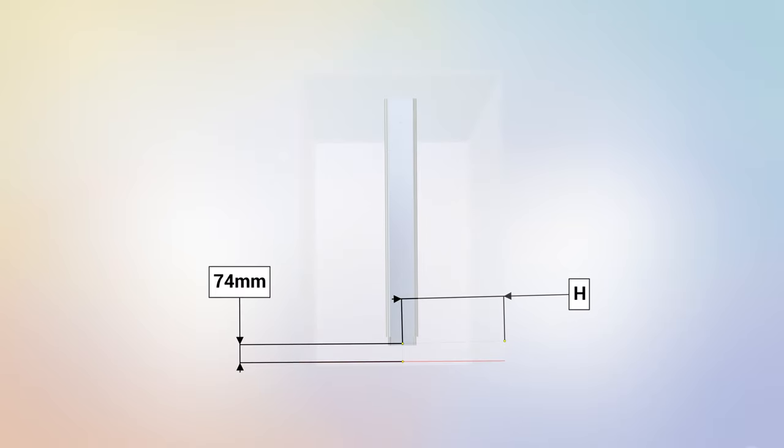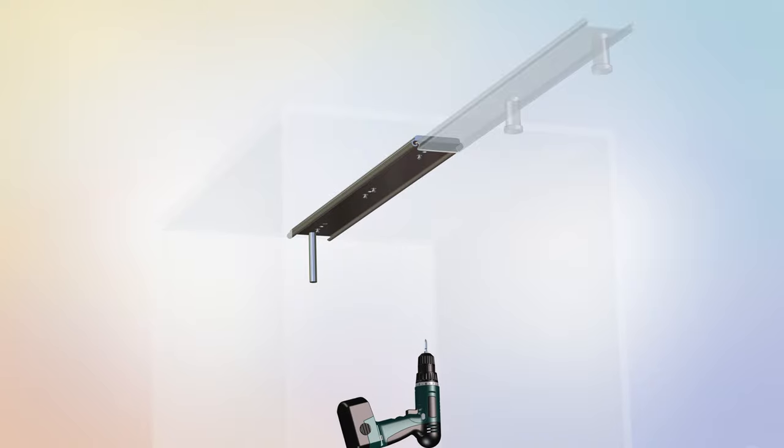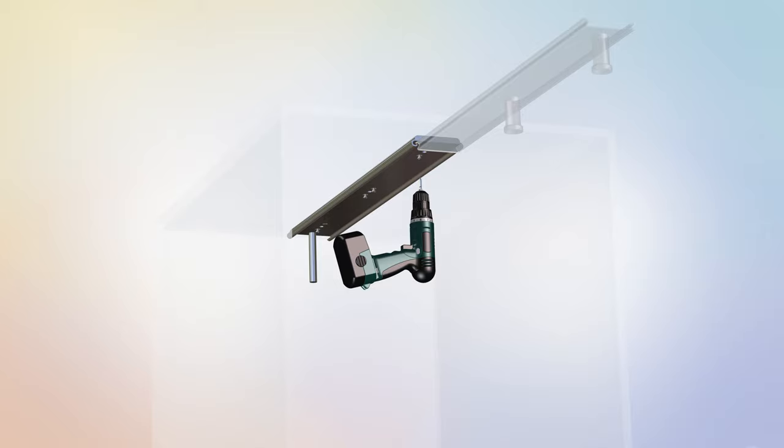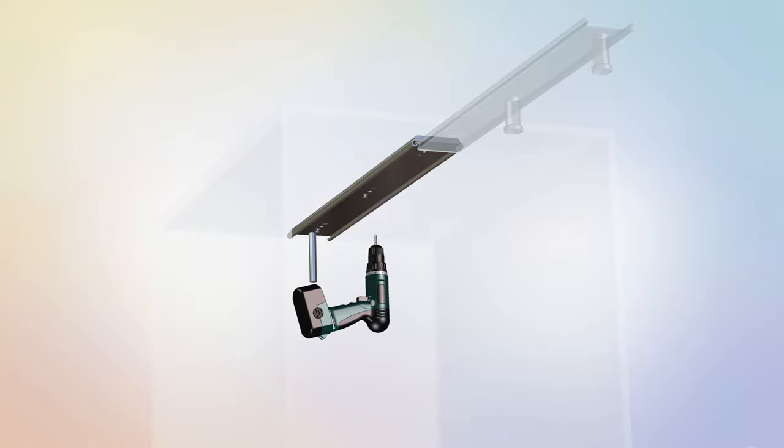Part A will be placed in the centre of the inner cabinet rooftop with a spacing of approximately 74mm from the open cabinet end. Please reference the correct number of millimetres from the edges as shown. Slide the track out of the way and secure part A to the cabinet using four part L screws. Tighten the screws using a power drill with a Phillips head drill bit. With the assistance of another person, ensure that part A remains intact and in place as it is being secured to prevent misalignment. Take care not to over-tighten the screws.